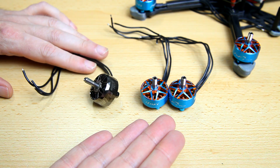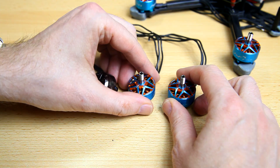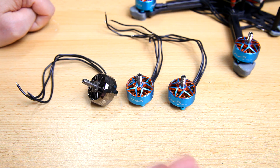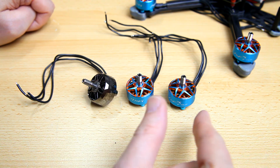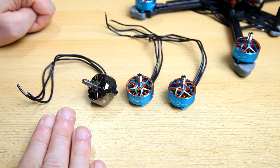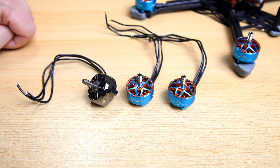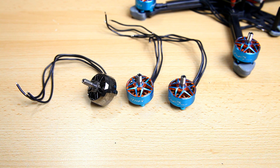Not an inexpensive motor either, as is the T-Motor. I don't do a whole lot of motor reviews and I'm not one for bench tests — not saying there's no merit to bench tests — but I'm simply looking for the best motor, one that feels nice and has a reasonable efficiency and power band. By power band I mean it's not spiky in the lower or upper half of throttle — as flat a torque curve as possible. You can only sense that while flying, in my humble opinion.